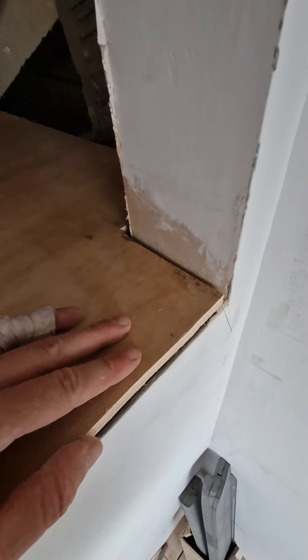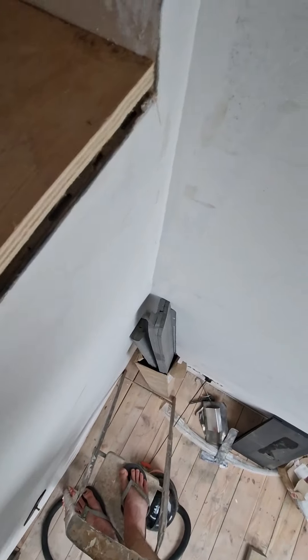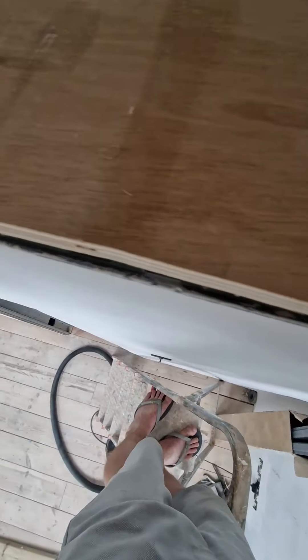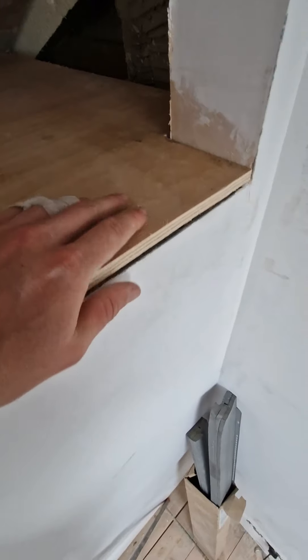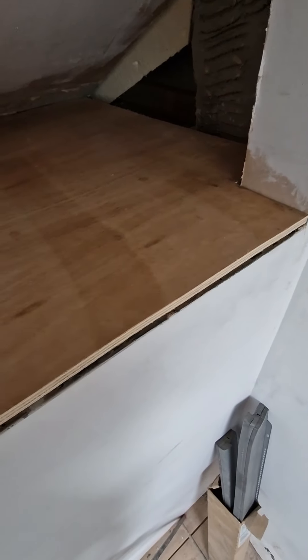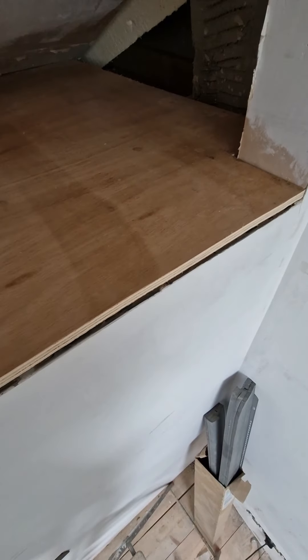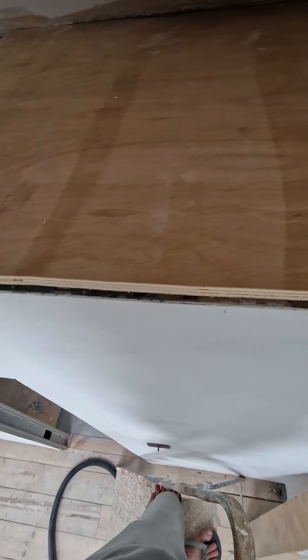You can see where my line originally went to — that's going to be spot on down here along the seam. So I'll get rid of some of this rubble. A bit of trial and error — night two of this board. Use a little scribe to cut in there so it's flush through the wall. I've cut along here using the edge as a guide, and it's pretty much exactly where I want it. I'm happy that that fits. What I'm going to do now is get this all sanded down and then it can be painted. No point drilling it in yet because it needs to be sanded and painted first.